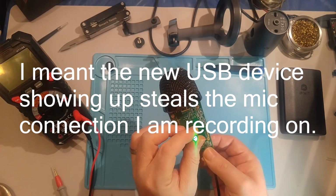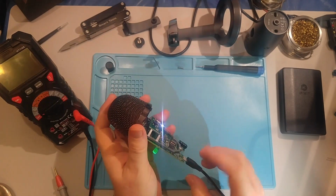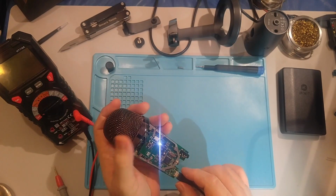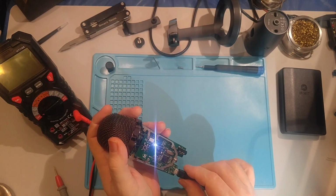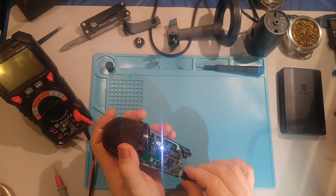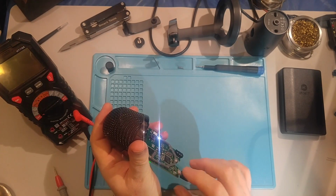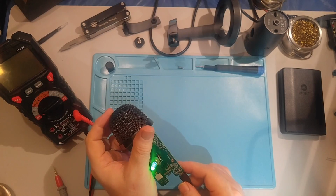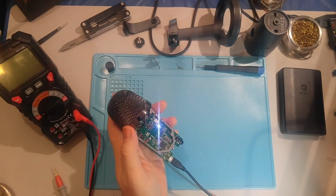But with an older, tighter USB male side, it's actually working a lot better. It still wiggles in an uncool way. So this port needs to be able to hold the cable more snugly. So I can either replace the port, or I could try to reform the port. I'll be back.